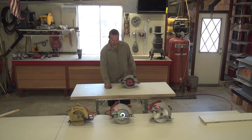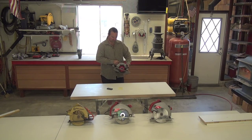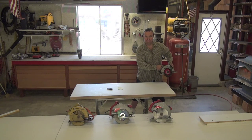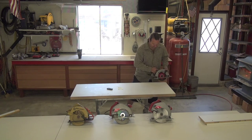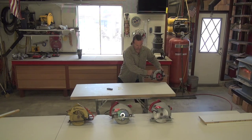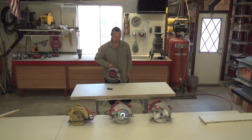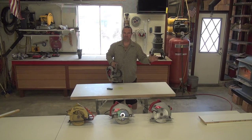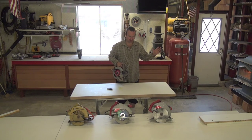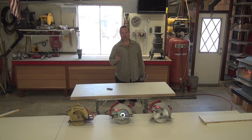There is risk involved here because when you are cutting backwards, you first pull your guard up like this, start off at the end, and go backwards. Even for somebody with a lot of experience, if your blade is not deep enough in the cut, sometimes your saw will have a kickback and your piece will go flying forward. But if you're doing countertops and scribing those in — something heavy like countertops or a sheet of wood — this is a technique that can really help you out.